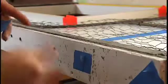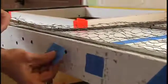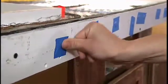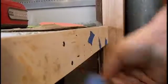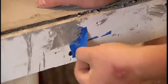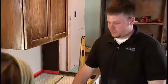It looked like, but you had a great tip. I was curious why you were taping off all the screws on the outside. Yes, after we pour the concrete, we'll spill some concrete over it. And it's messy. That's why we have paper everywhere, right? And the concrete will get in the screws, and it's hard to get them out. So we just put simple tape over it, and then you can pull it, and you'll have a nice clean screw to remove your forms. Okay, that's a great tip.